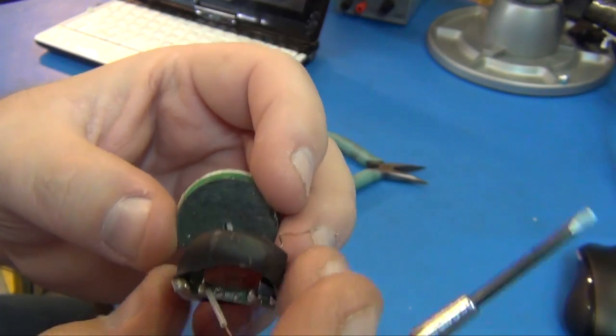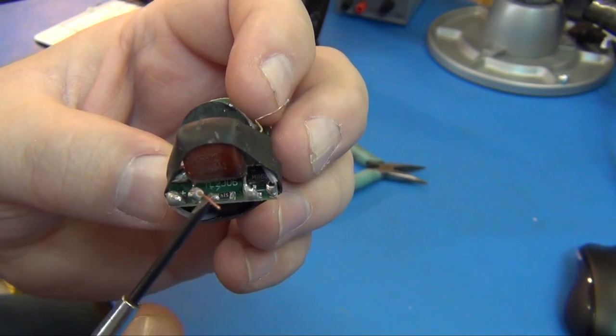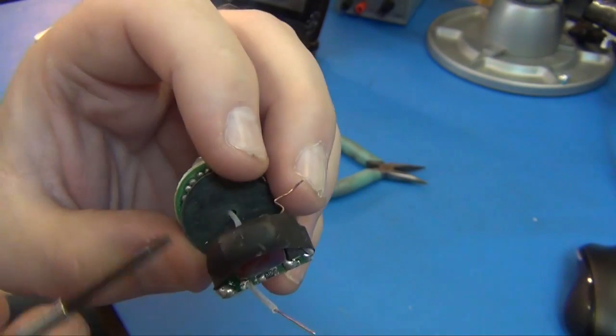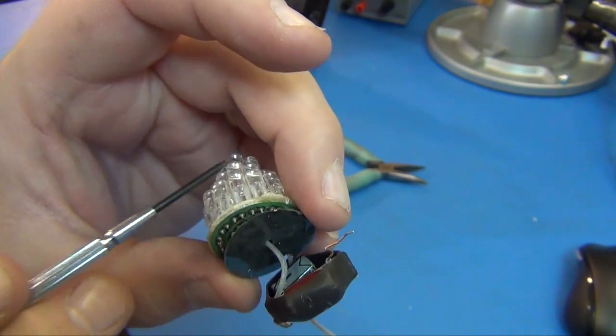This is the main circuit here. We have the neutral over here, it went to the case, and then this is the center tap, which would have been the hot side. Everything is encased inside of here, which will have to do the conversion down to run these LEDs.